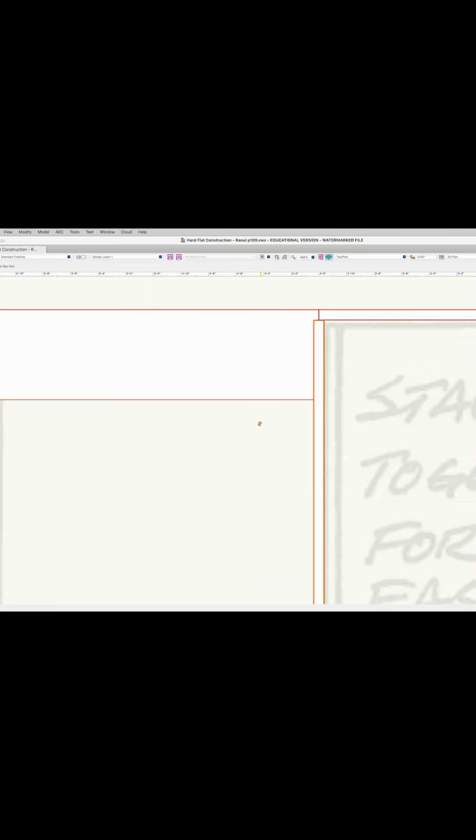In Vectorworks, I draw these by creating a guide box, starting from the outside corner. I adjust the size to 24 inches. Since all my studs are the same length between top and bottom plate, I duplicate my outer stud, then move it into place, centered on my guide box edge, and flush with the inside edge of the top plate.